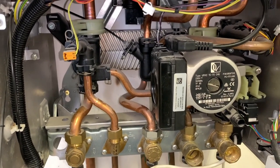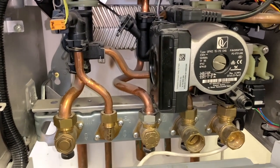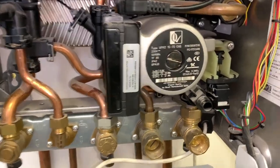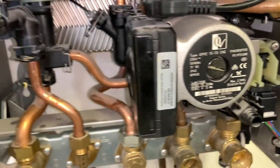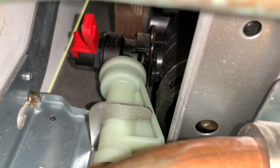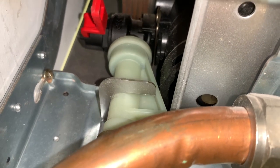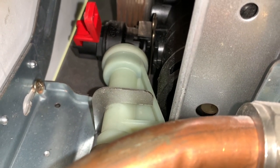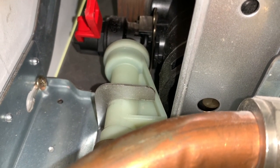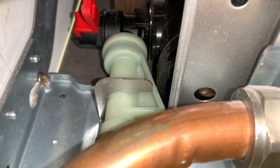Worcester actually say to take the full hydro block assembly out, and it would probably be quicker to do that. The plate-to-plate is only held in with a couple of screws - one on each side - but getting it out the back is nearly impossible. Another absolute pain is the blow off - you can't even see it. There's the blow off, up there at the back. Praise the lord they've moved it to the front on the 8000 Lifestyle, but you'll see loads of people whinging about replacing that - it's an absolute nightmare.